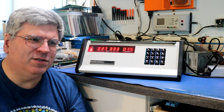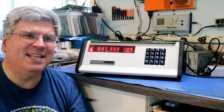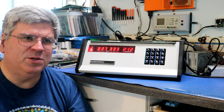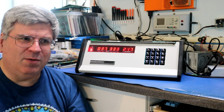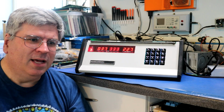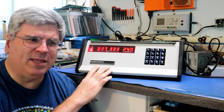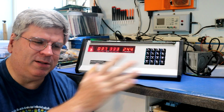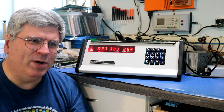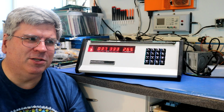So what I'm going to do in this video is talk about the CPU board that I designed to use the 8008, and I will talk about some of the complications and challenges of moving to an earlier CPU, one that might have lesser features or lower clock speed than you started with. It's actually quite challenging to do that. I had to completely rewrite the panel monitor in here and rewrite all the display refresh stuff because the instruction set was different. So we'll talk about what went into doing that, as well as demonstrate some of the things that I'm able to do on that.